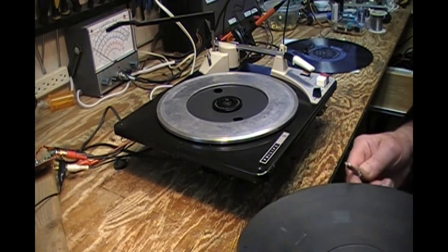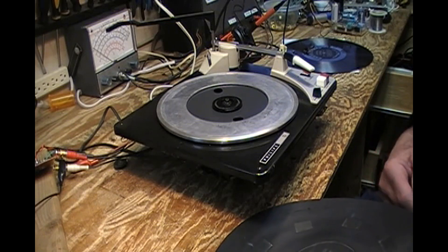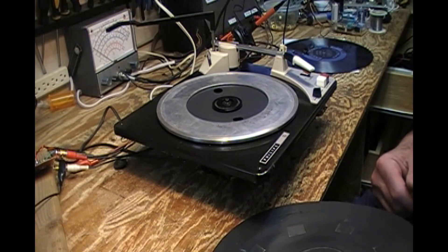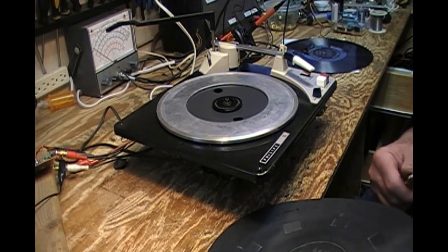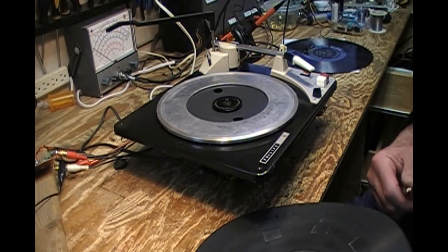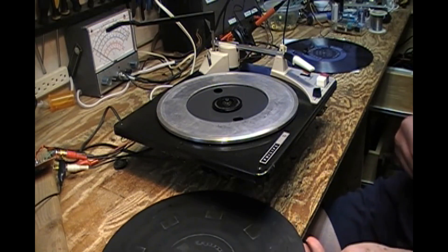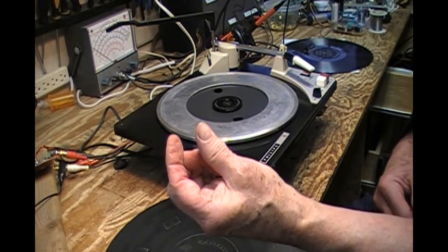I've done the cleaning and lube. While I'm definitely not a big fan of Philips changers, they seem to be overcomplicated with lots of fulcrums and points and sliders that need cleaning. The metal material seems to corrode and make a little fuzzy — I don't know whether it's pot metal or whatever. And the idler wheel — they're tiny, itty bitty things.